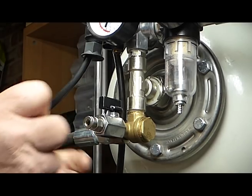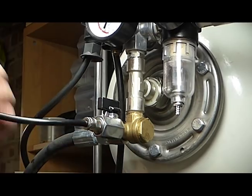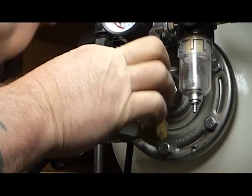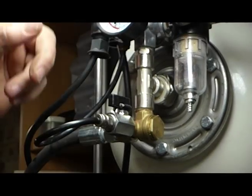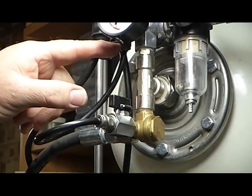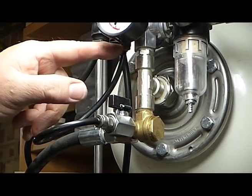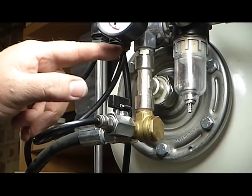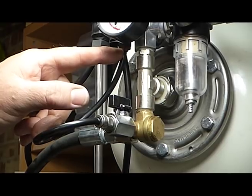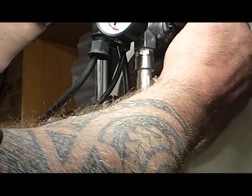Now this takes a 6mm hose, which goes into these wonderful compression fittings. I wish all of the machines had these compression fittings. And the Condor pressure switch has the same sort of fitting. Now, some of the Chinese ones, or the lesser Chinese ones, I don't know if Condor's Chinese, have an olive and a nut instead, which works fine. But the problem with that is that if you make a mistake, the olive's ruined and you've got to find another olive or another nut. It's very irritating. So these compression fittings are absolutely brilliant.